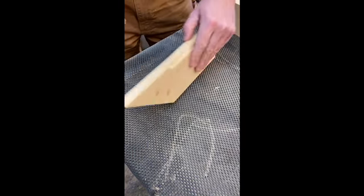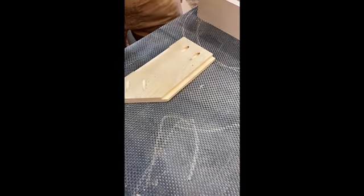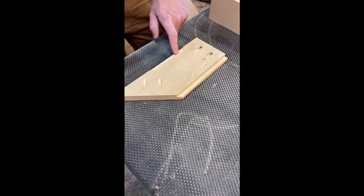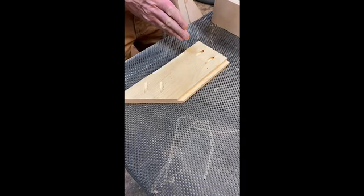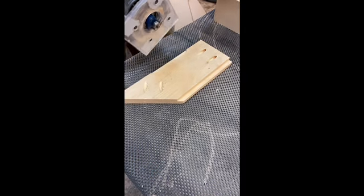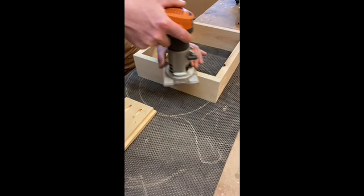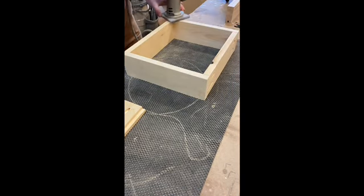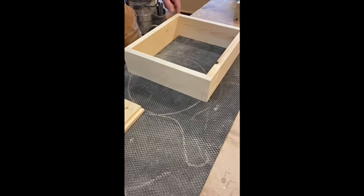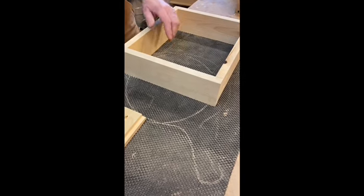On this particular box, I'm actually going to be doing it up on the edge, which makes it a little harder to balance, but we'll get there. I'm going to do the inside of the box. If I'm on the outside of a piece like this one, I'm going to move in the direction that you read, from left to right. I would come in this way, come up the side and all the way around, working in that direction. What happens is you go counterclockwise on the outside. If you have something that's inside like this, you're actually going to go just the opposite.